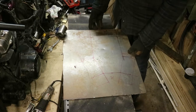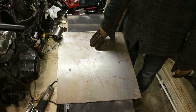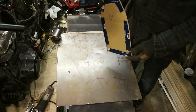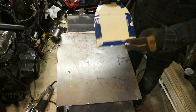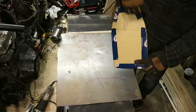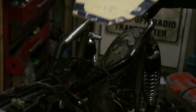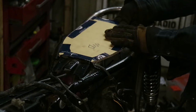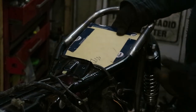What I have here is a 20 gauge sheet of metal left over from the scrap pile. I started with a template — just a cardboard cutout — which on the bike is just the basic cutout of where I want the pan to fit. I took this, laid it on top, did a trace from underneath, and it gave me this basic shape.